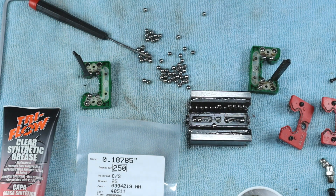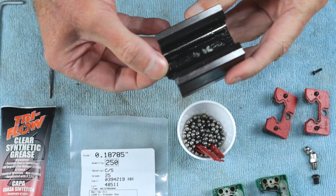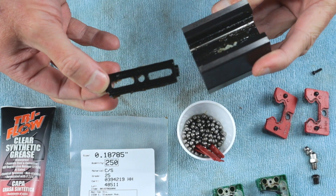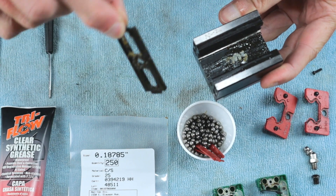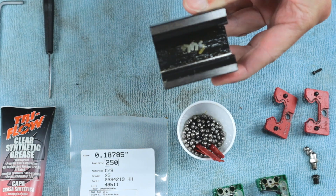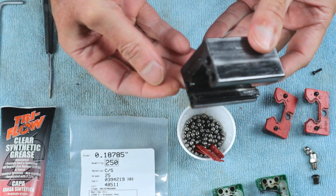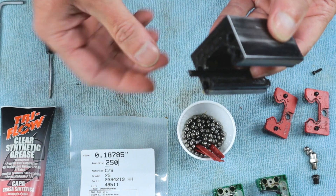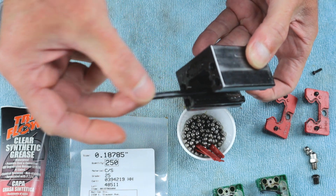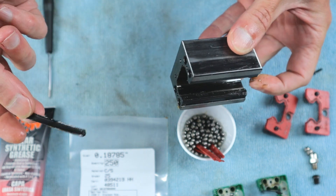Now is the task of getting them all out — that's easy. There is a clip at the bottom that just comes out like so. I'm going to take it out because it's full of grease and I need to get all of the old grease and chips out. Then there are the two floating guides I told you about — one comes out right here from the center of the groove.